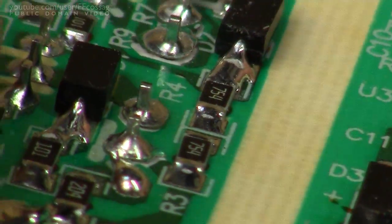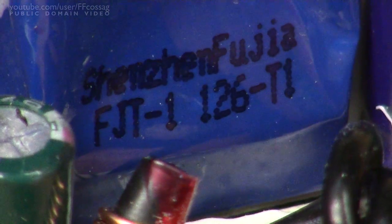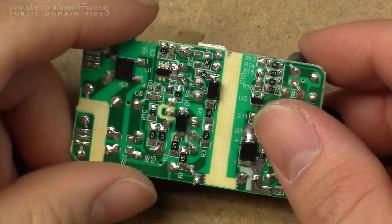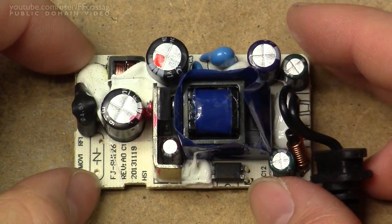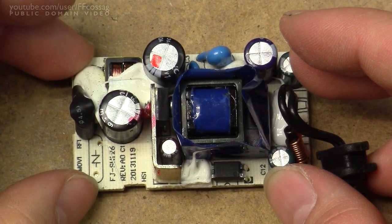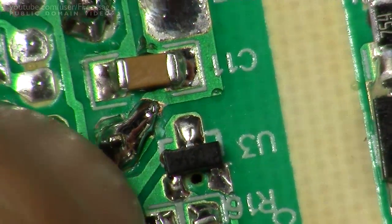We've got Shenzhen Fujia brand on the transformer and the part number too — FJ-T1 and 126-T1. So aside from falling apart when bashed with the hammer, I think this power supply is just fine, as it would be since it's being sold in Europe by a reputable retailer. Nothing exciting — decent quality power supply. The bad PCB traces won't last for too long, but it's going to be safe for as long as it lasts. All put back together and reinforced with some experimental wire.